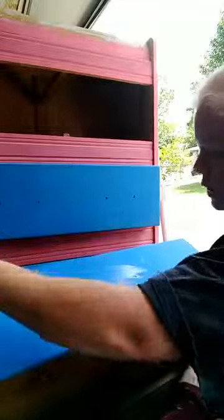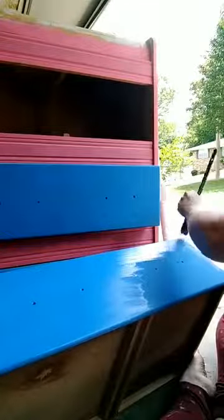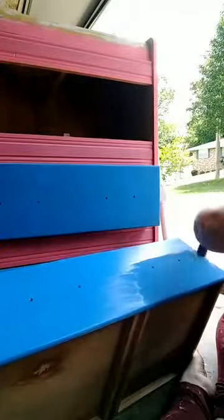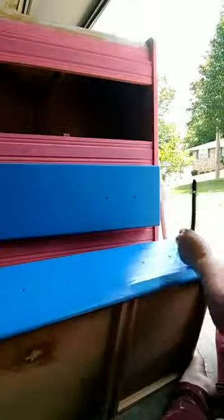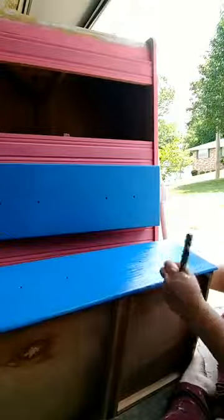The second coat is going on really well. That's the difference between coat number one and coat number two, right? There's such a huge difference. Even when you're doing a super thin first coat, it's the second coat that everything starts working on. Right before I finish, I always do long strokes so that I'm trying to eliminate some of the brush marks. It helps if you can do some long strokes, trying to get rid of those.